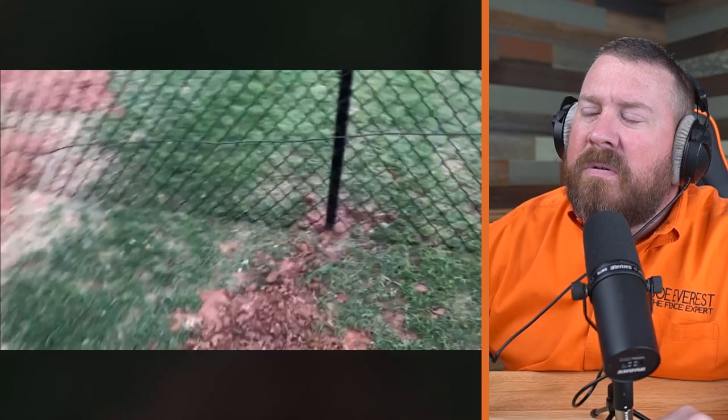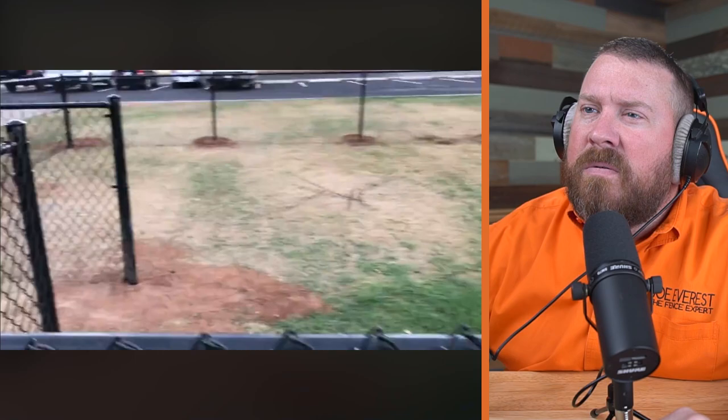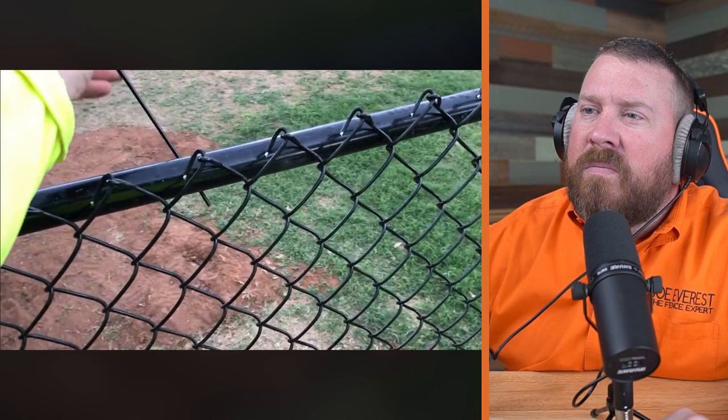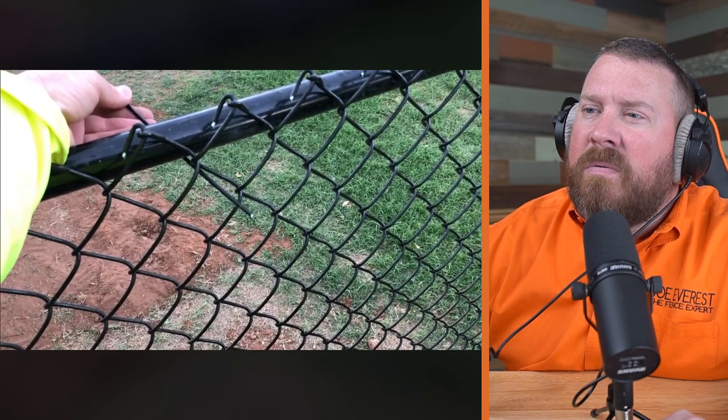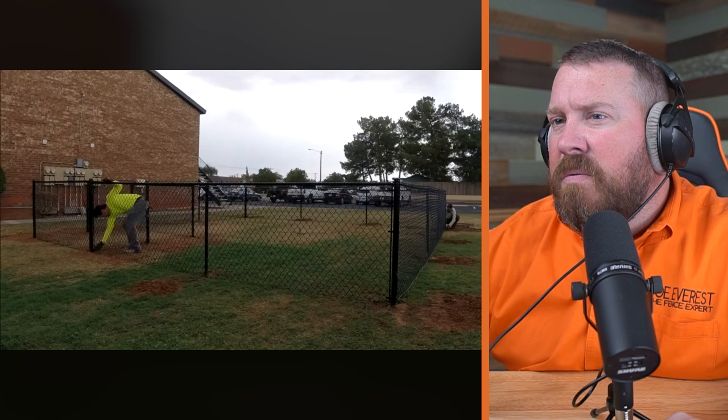And the line post there. So you just twist them around those posts. And then as far as the top, we use these little wire ties that go around the top rails and the fence fabric to keep those from also falling away from the top rail. So these are the things we need to put in place. And now we're doing that, just kind of going forward. And on the top rail, you put those twisted wires every few feet.